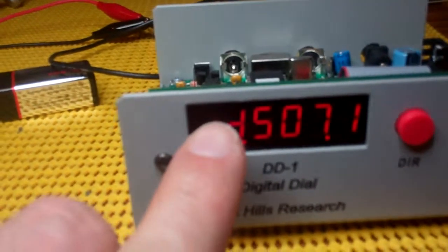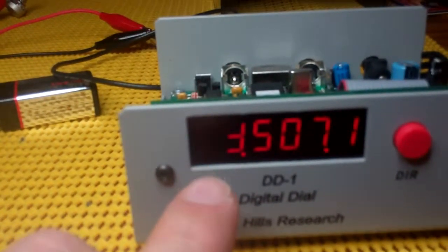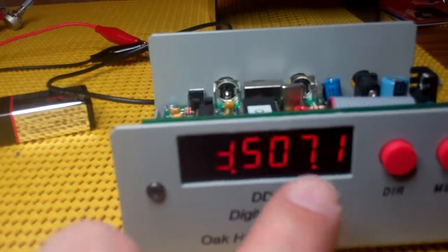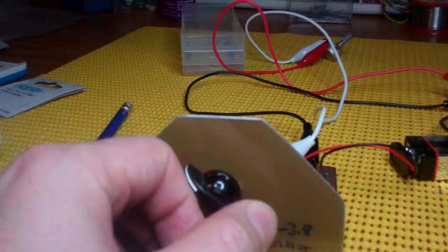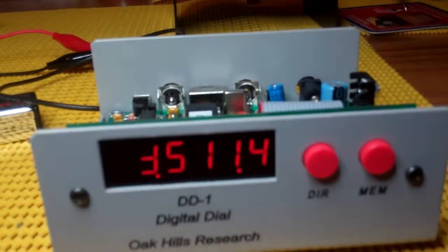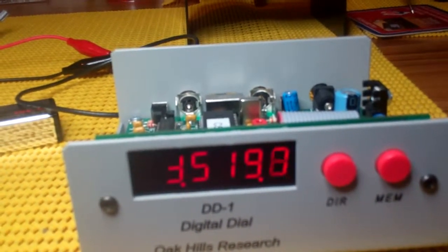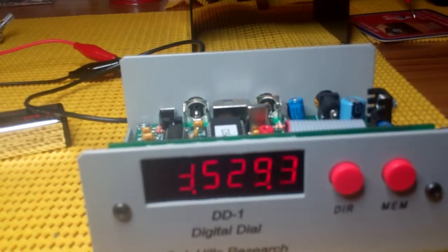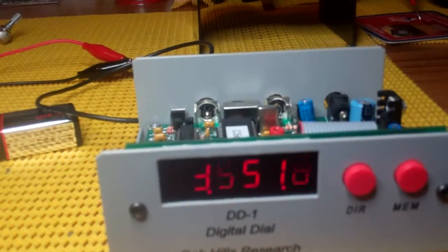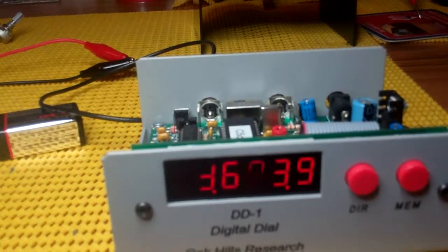You can see that the top LED there is missing illumination to make the number 3, but the other digits look to be pretty good. If I start just slowly increasing that dial, you can see pretty much everything else — all the other digits look to be pretty good, showing numbers. If we keep going up: 5, 6, 7 — they all light up. But the 3 is not.